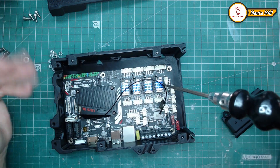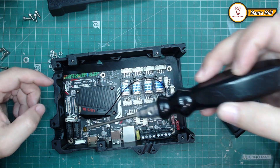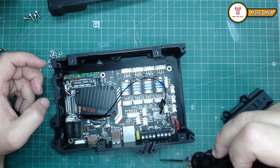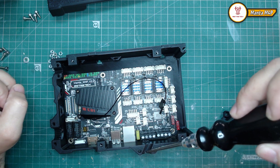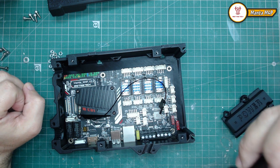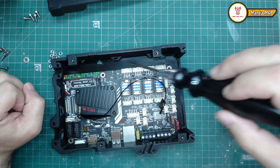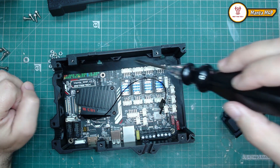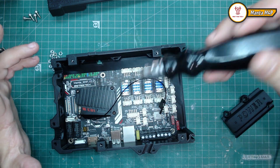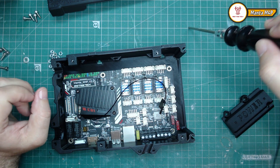You also have the part for the WiFi antenna, and one more spot here to pass some cables if you need it. Another one here for the heated bed — for a Cartesian printer this is a good place to pass the cables. There are also some points to put zip ties to grab the cables and organize them.